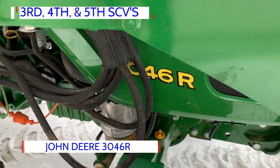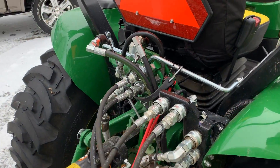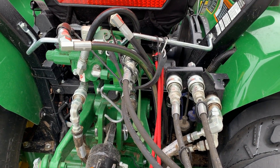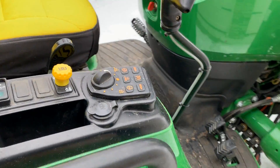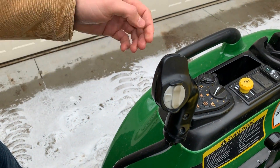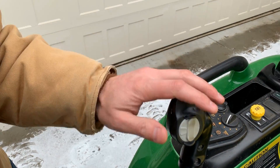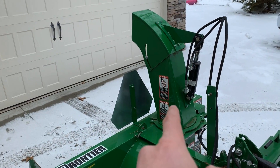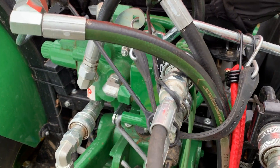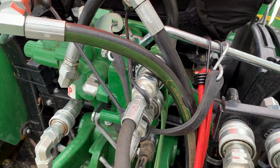This is my own personal tractor that I've had outfitted, so I'm fortunate to have quite a few options on here. We'll start out with the electro-hydraulic third function, which is controlled with a little thumb control. You put your thumb on there and push up or down to control whatever action is assigned. Right now I have it hooked up to control the rotating chute on my snowblower, so it can rotate left or right to throw the snow. That is plumbed back to this outlet right here — that's my third SCV. An SCV is a selective control valve.